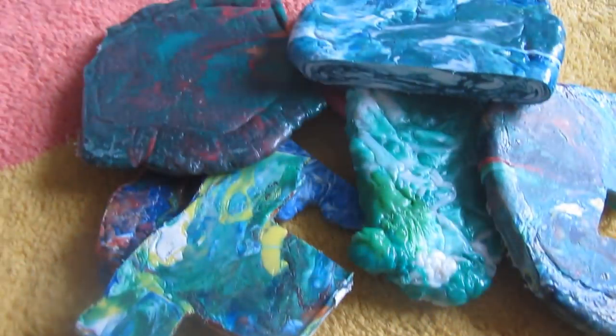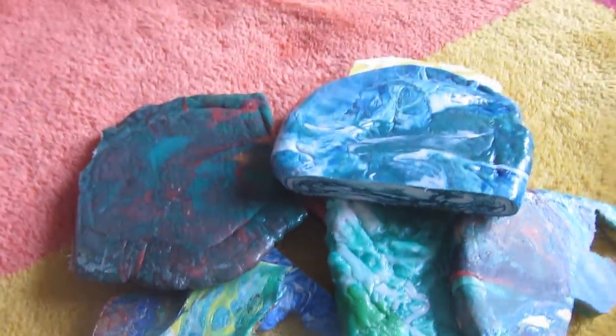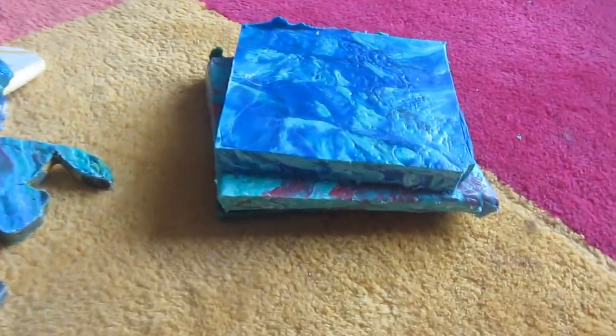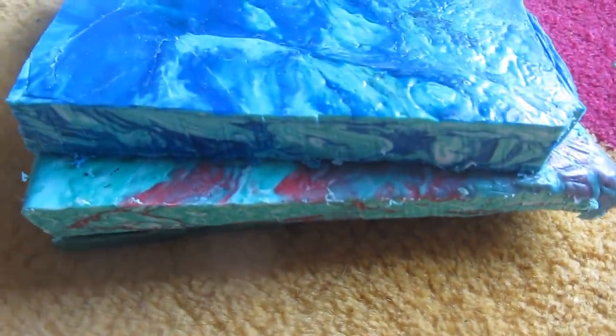In my past HDPE tutorials I put HDPE directly into a slingshot-shaped mould and that didn't really work because the HDPE stuck to the mould and it was completely destroyed while removing the final product. My next attempts were to make a flat sheet HDPE which created a flat sheet material that was quite lumpy and bumpy in a very irregular circular shape. This created a lot of waste material and wasn't very time efficient. In this new tutorial I'm going to be showing you the easiest method of creating these square pieces of flawless HDPE.